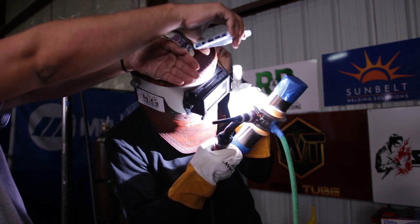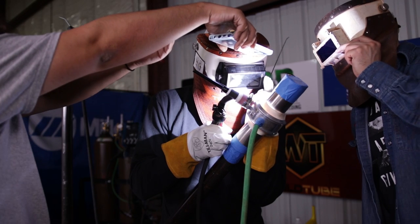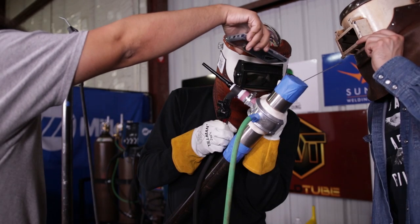I'm using enough current to open the keyhole and carry a liquid weld puddle. Once I apply a solid mass — the filler metal — and dab into the liquid weld puddle, it momentarily chills out. The weld puddle has to break down the solid mass being added to it. Dabbing breaks surface tension on the filler metal zone, deposits material into the weld puddle, which momentarily solidifies. That's how you deposit metal over distance: the liquidification and solidification of a weld puddle, stacking liquid puddle onto previously solidified deposit metal. That's the essential nature of all welding.